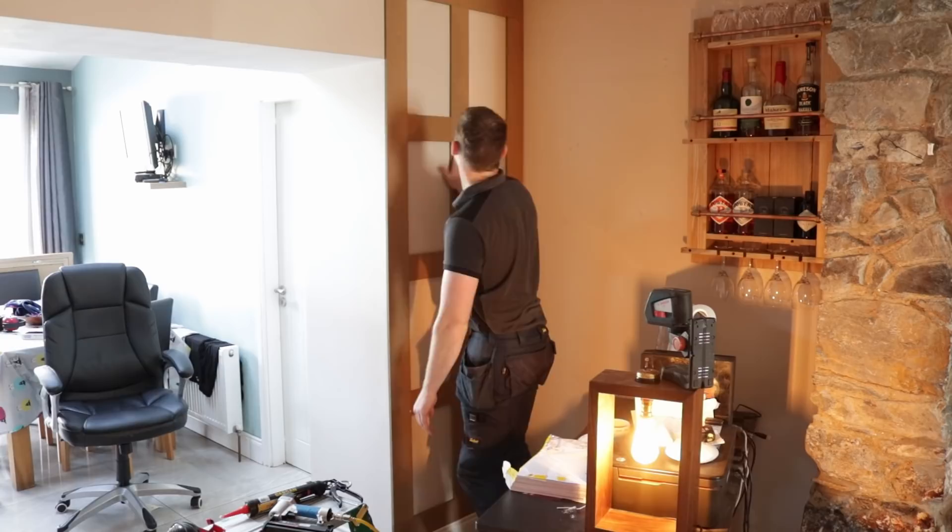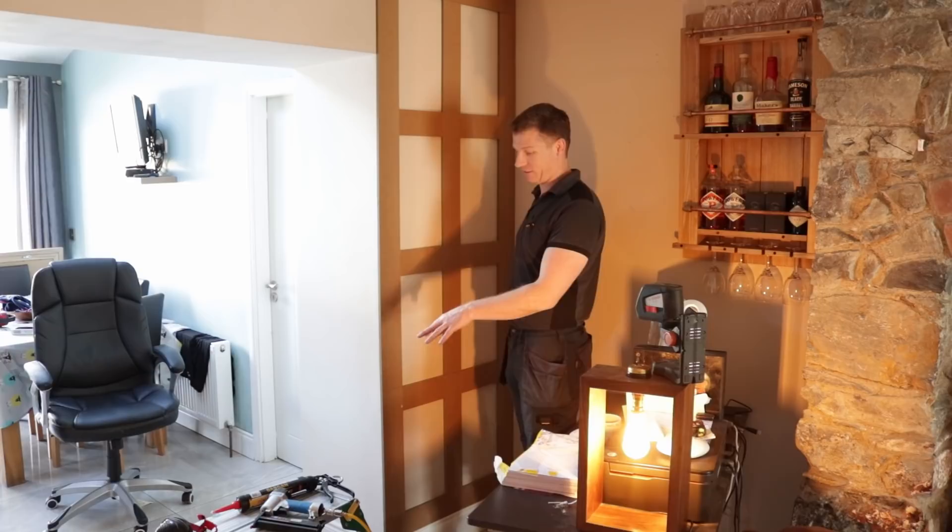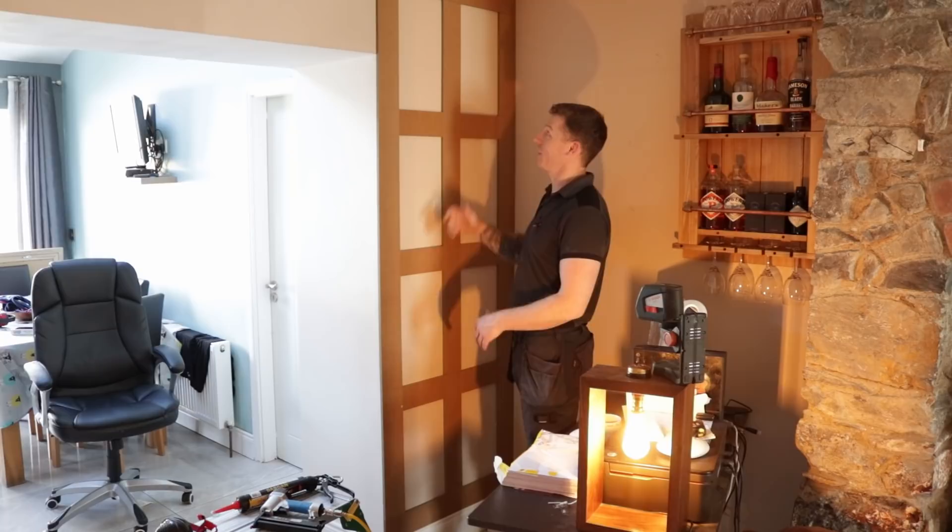That corner is finished and it is that quick and easy — just glue with some adhesive and then tack it just to hold it in place. If you don't have access to a brad nailer, some tacks and a hammer will do the same job. Just tack them in place until the adhesive sets, then you can pull the tacks or drive them home. No problem whatsoever.